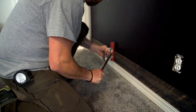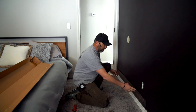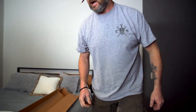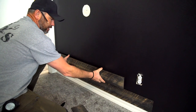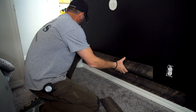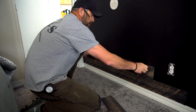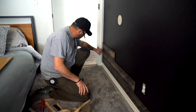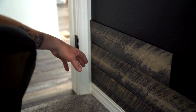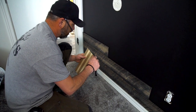The roller should be easily available at any of your home stores — nothing fancy. It just applies a little pressure and evenly sticks the glue. Now we're going to work our way back. You never want to stack your seams. Just kind of see what's mid-length in your pack. Test fit and make sure you like where your seams are going to be. Get it tucked into your edge, bottom nice and tight, then stick it. You get a few little edge imperfections — I kind of like some of it, it leaves a little more of an old-school plank look. That's also the reason we painted the wall black, so you don't see through any gaps. It adds some character.